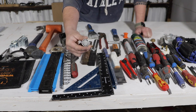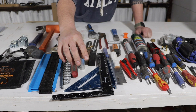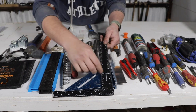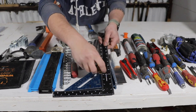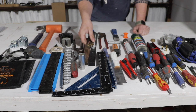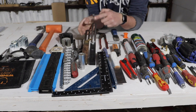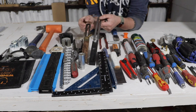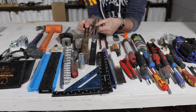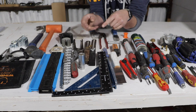One of these supposedly fits anything — it's rubbish, don't bother buying one of them. I'll keep it in there because I've got it but I never use it. Speed square and then I really like this square — I can combine it with these attachments and it gives me a really nice square that I use all the time. A pair of pincers and then a pair of sliding bevels. I keep two because if you're doing roofing you need one for your seat cut and one for your plumb cut — and they're completely different so you can't mix them up. I'd recommend having two that don't look the same.